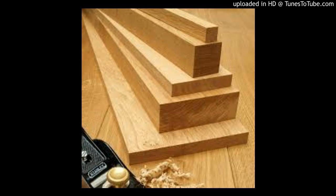Well, now the problems start. We've convinced him not to use a 50mm joist. We haven't got to go through that again. And basically, they continue to lay out the decks like an ordinary veranda at 450mm centres. And how do you join a piece of decking on a 50mm joist or even a 75mm joist, with 4 screws concentrated together? They're too close to the end, it splits the decking, and you can imagine what the joist is like under that. Not very good.